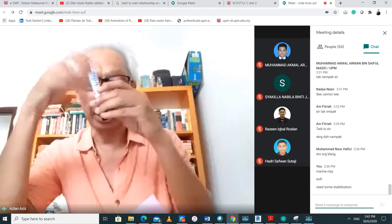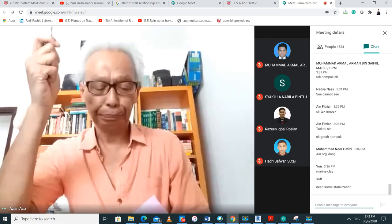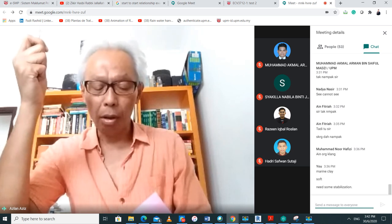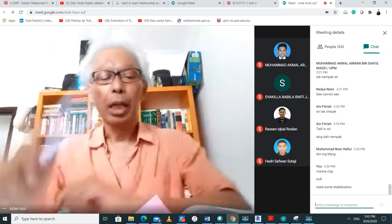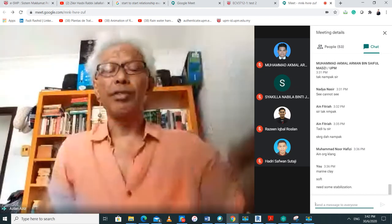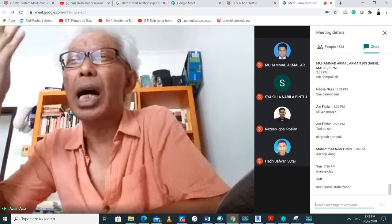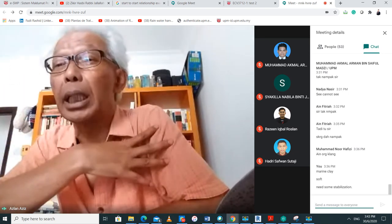So this is already giving you the idea that I'm getting my strength from the tip and from the soil around it. Otherwise, if you look into the standard, it's on page 3A, BS 8004 Code of Practice for Foundations, or figure 8.17, grade, is based on installation methods, large or small displacement. The top part of page 3A is just to give you an indication of the type of piles available in the field. In other words, how do they install this pile, which bears on the classification of the pile.